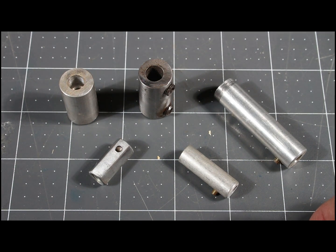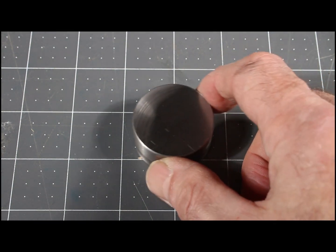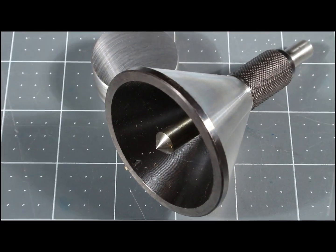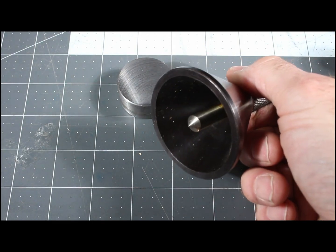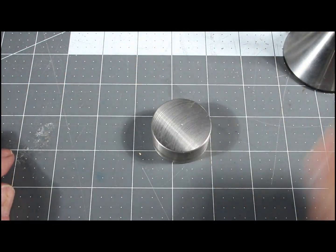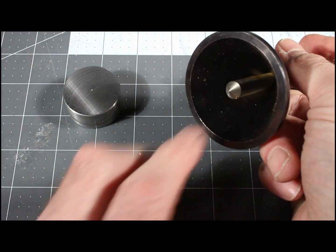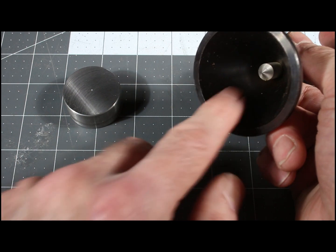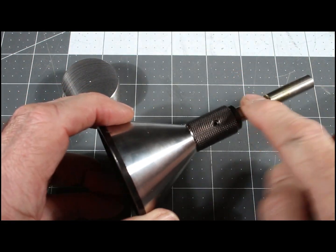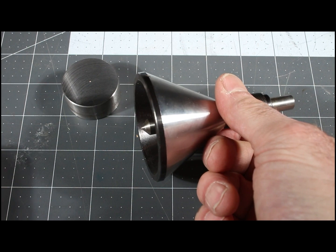There are some wonderful tools that will help you very simply find centers of cylinders. Here's a sample cylinder about an inch and a half in diameter. This tool right here is amazing — it's a center finder that you just drop onto your object and then whack it with a hammer or a convenient piece of metal, and there is your center. It slides in and out to set the diameter anywhere from two and a quarter down to just over a half inch. It has a shaft flat with a set screw so it can't go further than the full travel you need. There's a link below to this, as there is with all the tools I'm showing today.